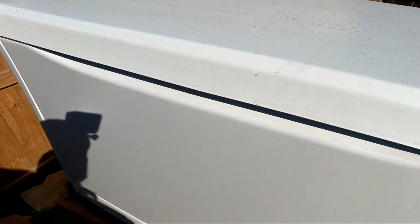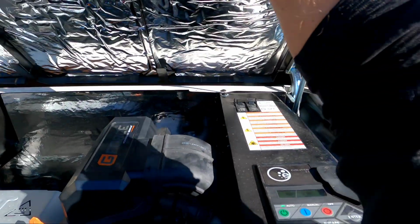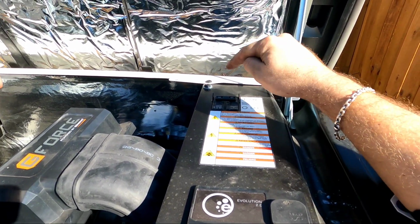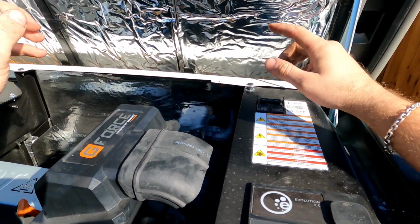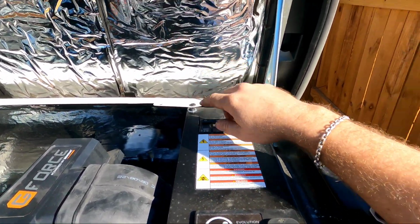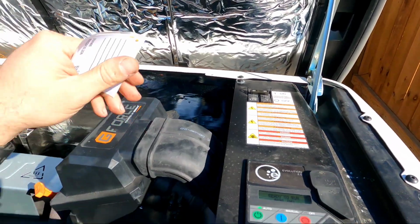Now, before you guys ever start servicing this, you want to make sure the very first thing that you do, and the only thing you really do, is turn this off. Turn off this breaker only. Don't mess with the one that's actually connected to the building or the actual breaker to the home. Only turn this one off and you're good to go. You've isolated the generator from the actual unit of the home. Then you shift everything over to manual and you go from there.